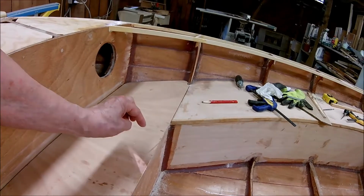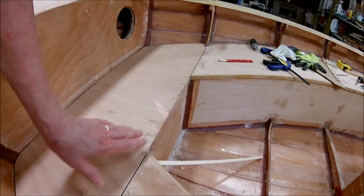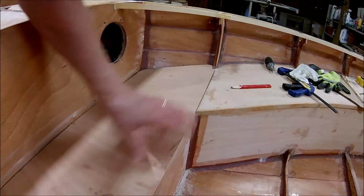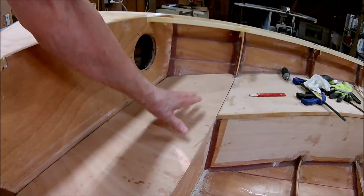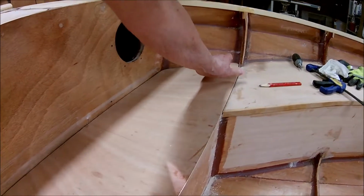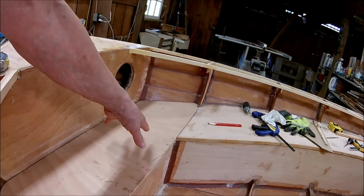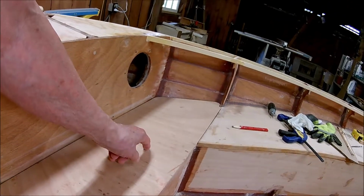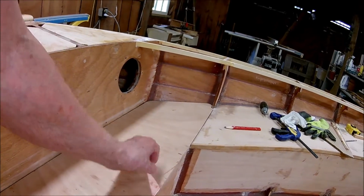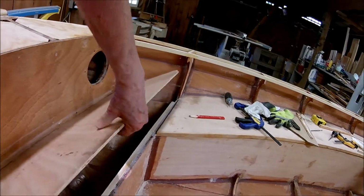And if I'm going to put a latch in the middle, it has to be curved more than this locker, so that when I push down on the latch, these two wings compress and everything sits flat and doesn't sit there and rattle for the rest of its life. So I've got to get more curve in this thing than the boat has, so that when I press it down, it's flat and latch it. All right.